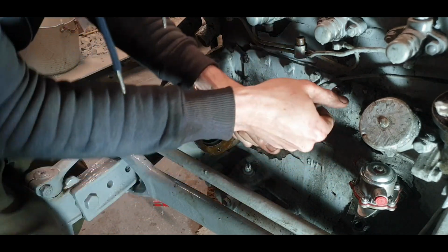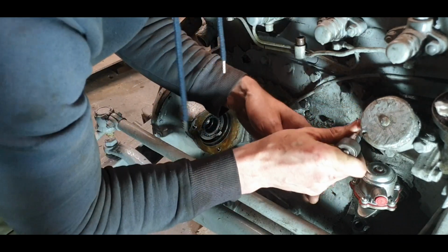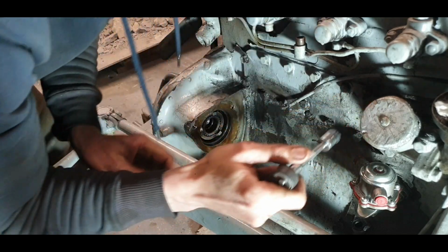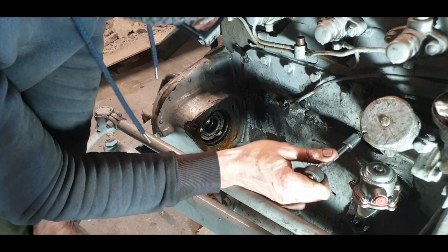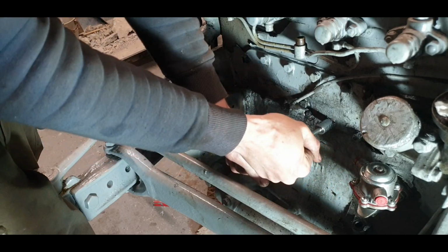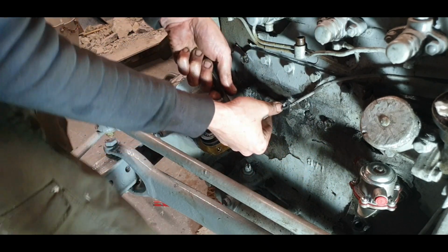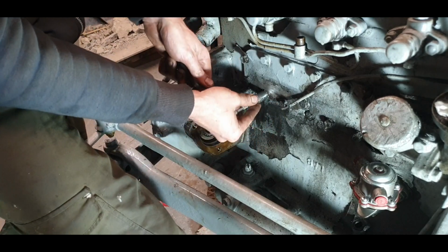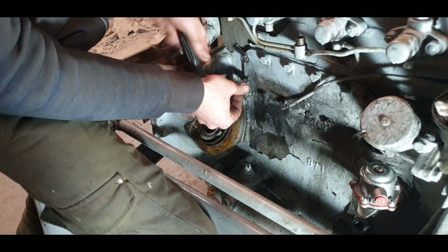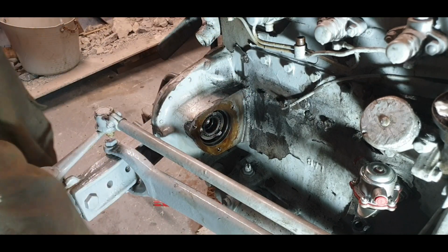So this is the time to do this. It's a little bit harder when the pump is on. I remember trying to tighten one up with the pump on before. Good luck and good night, as they say. These are a coarse thread, bolts I should say, and oil runs down along them, so you do need them tight. That little bolt there was definitely leaking. So, okay.